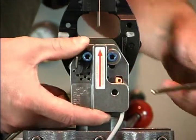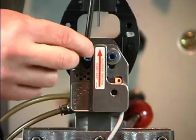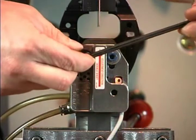If the switch still flickers, continue to the higher-numbered hole until the switch does not flicker. Tighten both screws to 85 inch-pounds. The switch is now set.